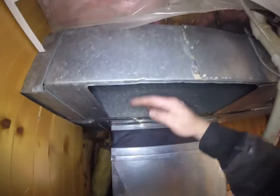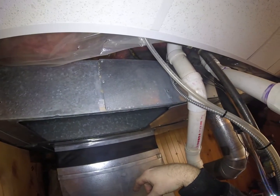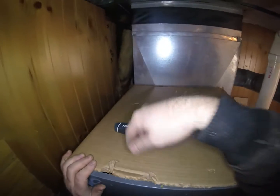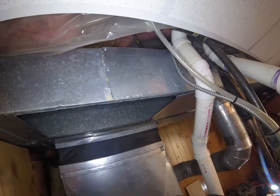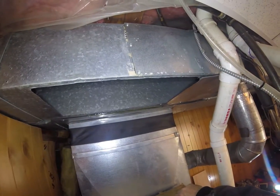Normally what I like to do is bend a lip down and put a piece of slip cleat, and then slide my transition right into it and then screw it down into the top of the coil. But we don't really have enough meat to do that here. I'll just bend down what we got. I'll jam a piece of S onto it and we'll make it work.